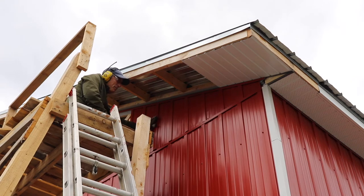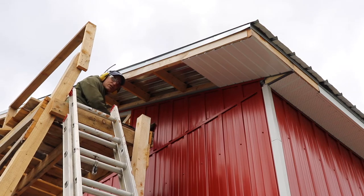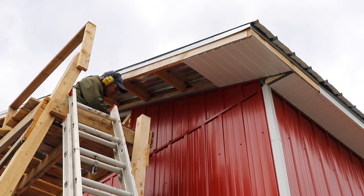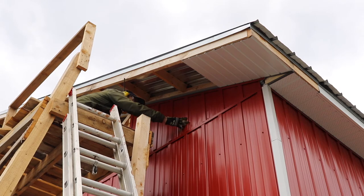This is great. What's happening is that these are the offcuts from the panels on the other side. So you cut a diagonal panel for the other side, and the offcut becomes the panel that fits in here. The bonus, of course, is that these are going up super fast. I literally don't have to spend numerous minutes with each panel measuring and cutting. They're all ready to go. And this one here, I did not punch because I wasn't sure it was going to fit, or if it needed some kind of trimming. But there you go.